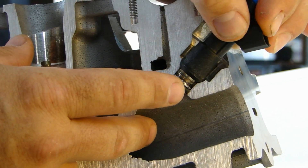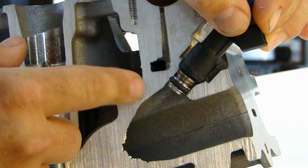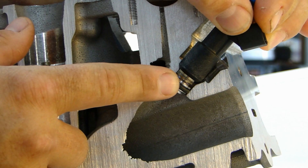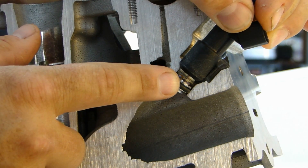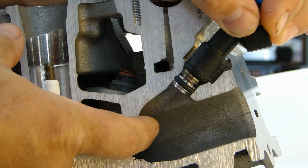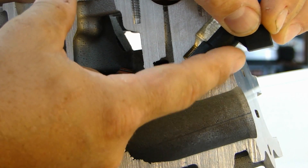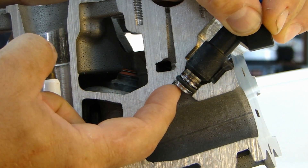When the fuel injector is put inside the engine, it would be put in right like this and it sits exactly right here. This black O-ring is the only thing that seals the fuel injector inside the engine. You only need one O-ring and it's a very light O-ring — not that hefty. If you get a cut in here, you'll get a lot of extra air in your engine and the engine will run lean. The reason you don't need a hefty seal here is because air comes in through the intake manifold and this fuel comes out of the injector sprayed as a mist — the fuel mixes right here and this is a vacuum, so air is being sucked in past the injector. This O-ring seals air from being sucked in.